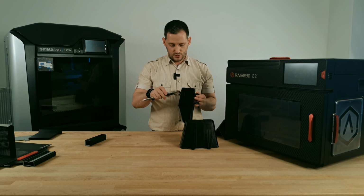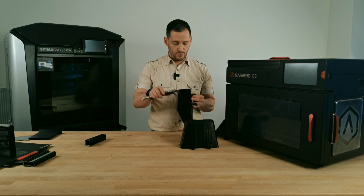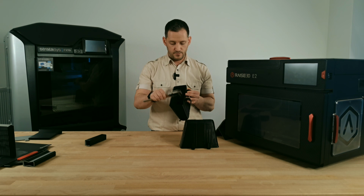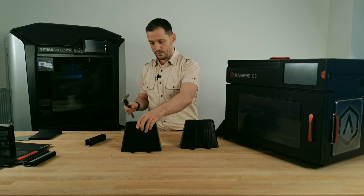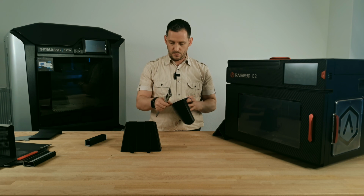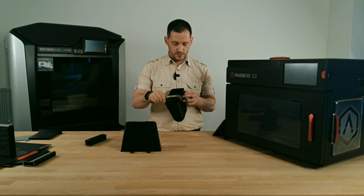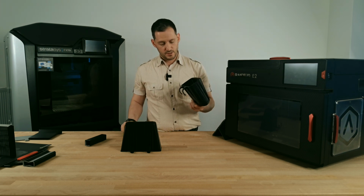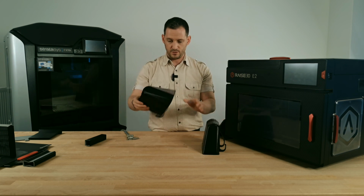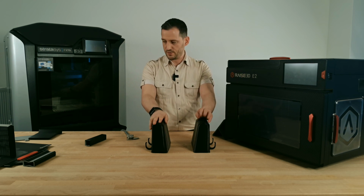And the wall thickness on the Stratasys part is 2.4, 2.5, 2.5, actually great. This is great. Dimensional accuracy is fantastic. Let's see. We have 2.6, 2.6, 2.6, 2.54. So this is okay, but it is not as good as what we have with the Stratasys printer. So dimensional accuracy, the Stratasys printer wins on this.